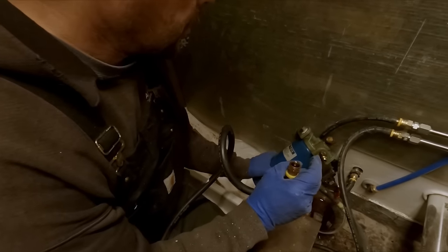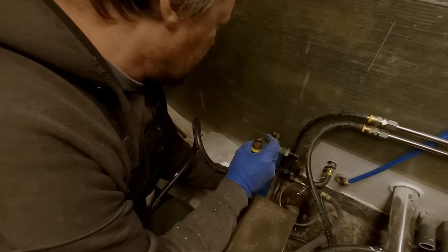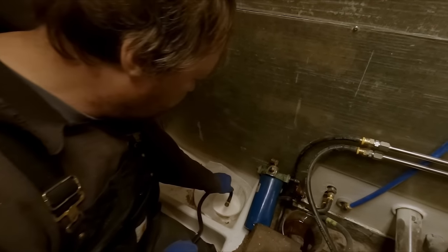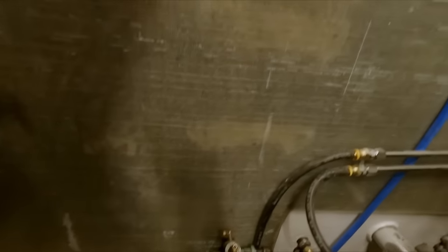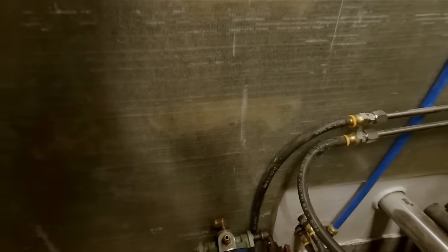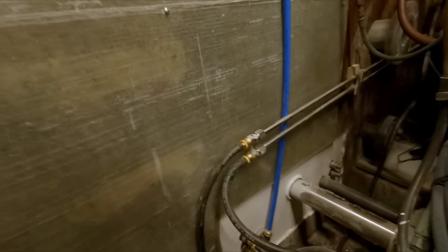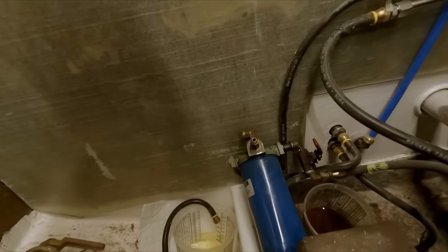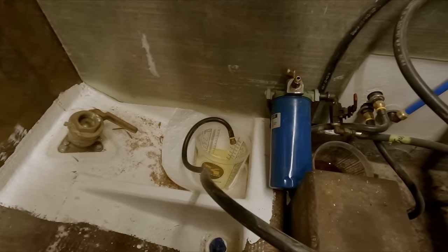Dry as a bone. Wow. So now this will leak everywhere because it's unattended, even though it's in the exact same position it was earlier. That's how that seems to work for some reason. So our goal here is not to put too much water in that tank because we're going to have to dispose of it. It's like $2 a gallon to get rid of oily bilge water, which isn't bad. But we certainly don't want to fill that tank up to the top. So we can just get enough in there to get the fuel out and then just start to see a little bit of water coming through at the end. That'll be ideal.